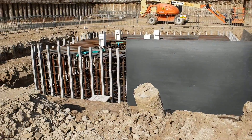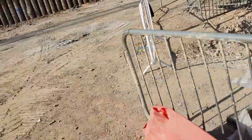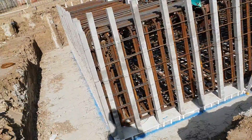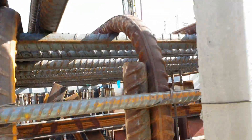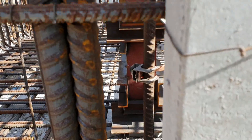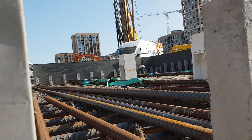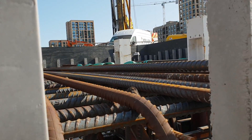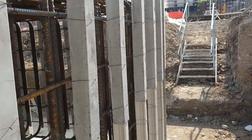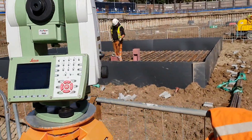We're preparing the crane base for backfilling now. We have to backfill slowly and carefully from each side — slowly, not to move anything. After that I'm going to double-check the crane anchor position and the pipe as well. After backfilling I'll mark the two columns — on this pile cap there are going to be two columns. There's top steel to come on top, and we've got the lightning protection connected here — a tape going into two legs, one here and one on the opposite corner.